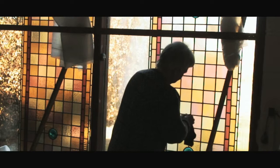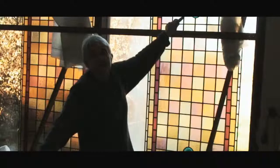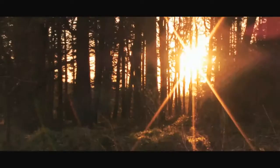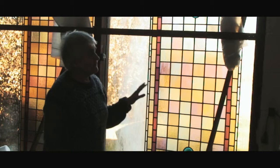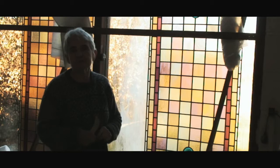You can see that this window has got some really nice elements — for instance these beautiful circular turquoise pieces, which are little roundels, almost like little wine glass feet. This kind of glass is very characteristic of late Victorian, early Edwardian work, and I think these windows were probably put in around the 1890 mark originally, so they've survived quite well given their age. We usually have to replace the leads after about 100 years, so they're not doing too bad.